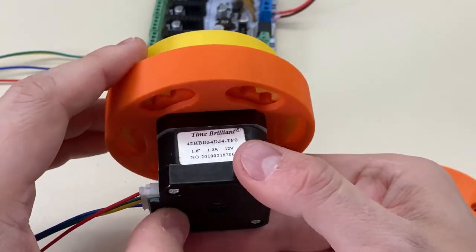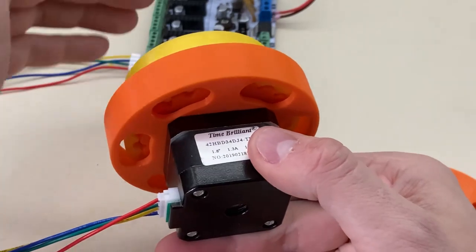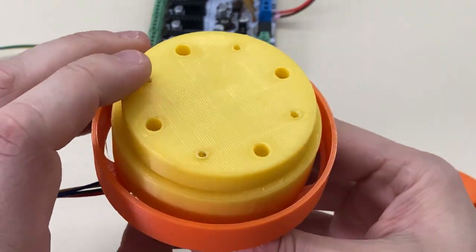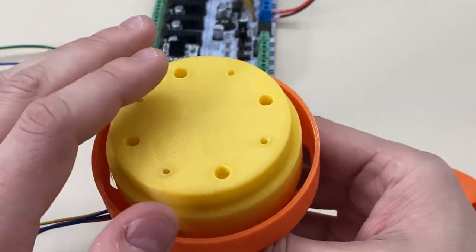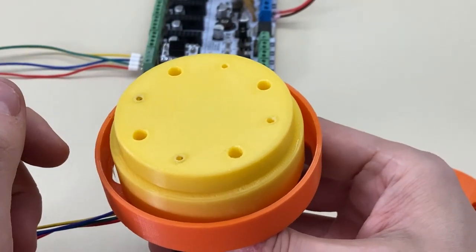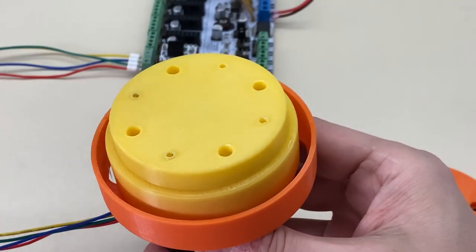What else can I tell you here? Because I can't reprogram this board, I can't change the timing, which means I can't run it at full steps. It's stepping so fast that at full steps it fails to start. Basically what happens is you need a certain amount of time between steps for the motor to actually finish a step.